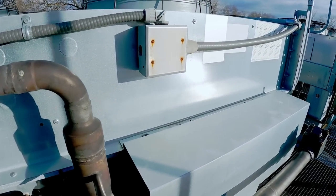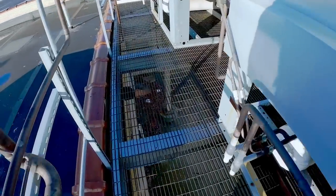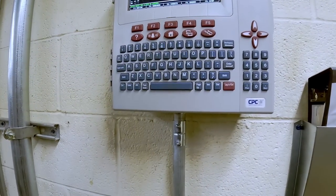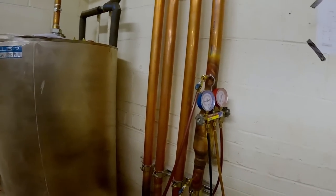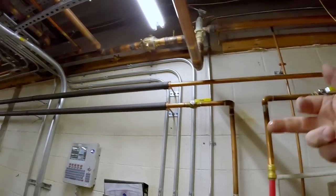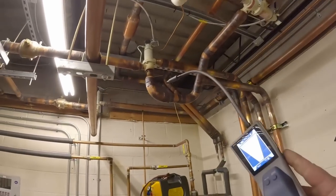Yeah, we're shedding — we've got half the coil shut down. It's cold out here, split condenser. My levels are super high. This one here has obviously dropped down because that's the discharge side — we're isolated there. Oh gosh, there's oil there too. I need to go grab my leak detector.